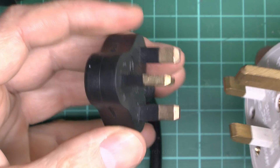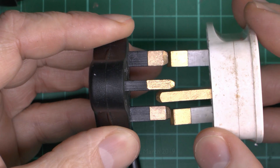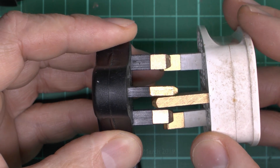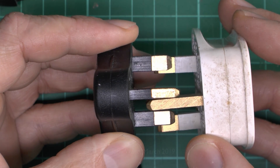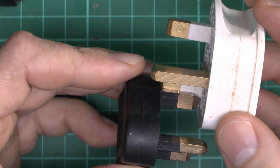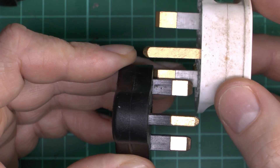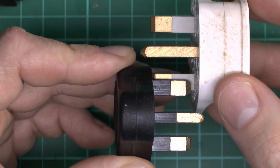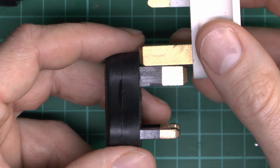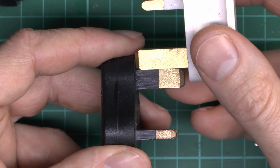As well as all those massive fails — which make it extremely unsafe — if we have a look at the pins, this white one is the correct size. We can see that the pins themselves are actually too small, certainly in the width — there's a considerable difference in dimensions. And in terms of the length of the pins, they're short as well. This one is right up against the plug, and you can see the other one has a clear gap on the side. And if we compare the earth pin, which should be longer, it's also too short — you can see my finger underneath in the gap.